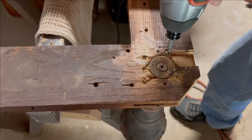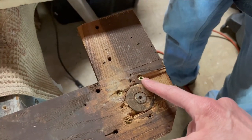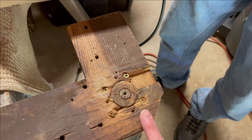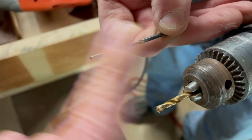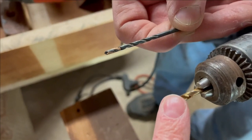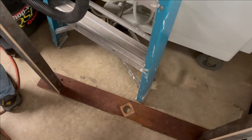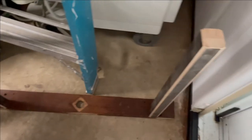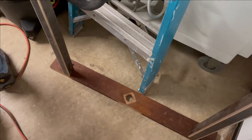As you can see, we have reattached the legs with screws instead of nails — I think it's a lot more sturdy. These are two-inch exterior wood screws — it's what we had on hand. He used two different drill bits: one to make the hole for the screw, the other to make the hole bigger so he could countersink the screw so it doesn't get in the way when we attach it to the base. Now the front legs are attached and the bottom legs that we created from the hat rack are attached with a nice new detailing. This is where the hole was for the third leg — we decided that wouldn't be sturdy enough, so we went ahead and made these other legs from stuff we had laying around. I collect a lot of stuff — never know when you're going to need something to build something.